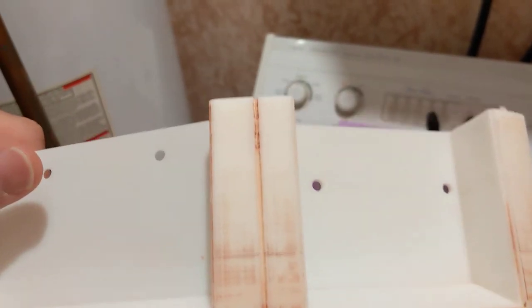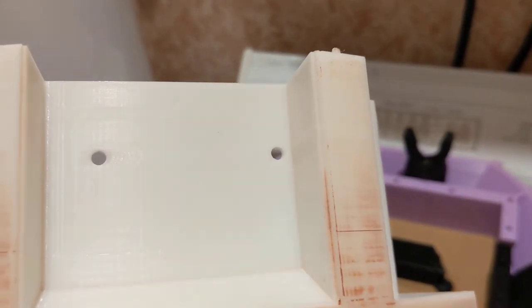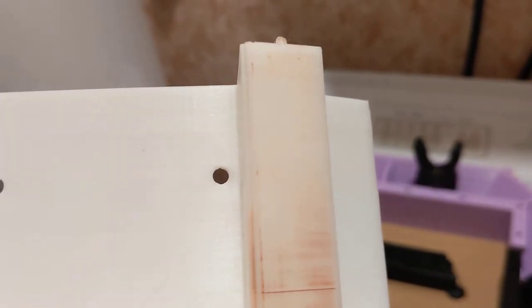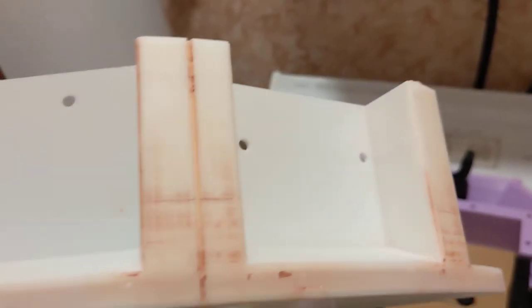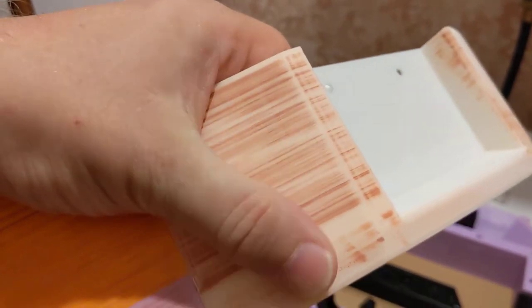So I put that on, and then that showed me some areas, like these areas here that are plain white right now. They had some raised artifacts, part of ringing. If you see the holes, they were exactly adjacent to the holes. And here they were up near the top. This one they were a bit lower. So I sanded the extreme plastic that's too high, and then just figured I'd put a real thin coat and then sand it back to the plastic of the glazing putty, and then I'll go ahead and prime.